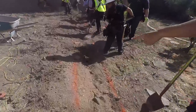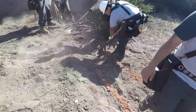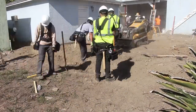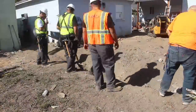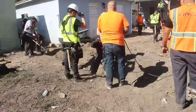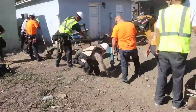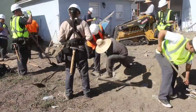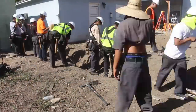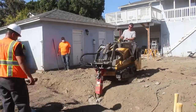We painted out the line, and there are three different systems we can use for this block wall. There's a design where you go narrow and deep, a design where you offset the footing to one side of the wall, and a design where you do a spread footing equally on both sides — I believe they call that the T-type. That's the shallowest of all of them, and that's why I chose it. It's the shallowest but the widest, and I like shallow for the simple reason that I won't get into underground utilities of any kind. It's a no-brainer.